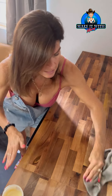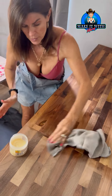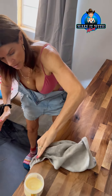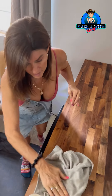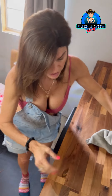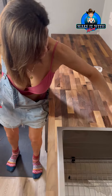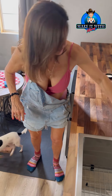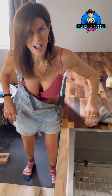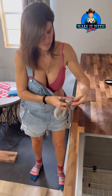Now you can see where I hit my seam. This is where the two pieces come together when we put the countertop together, so I'm hitting that seam right now. If you've been following me, you should notice this is where I was installing the countertop. Now I'm working around where the sink was cut out, and this is a wet area, so I want to put extra wax around the wet area to give it as much protection as possible.